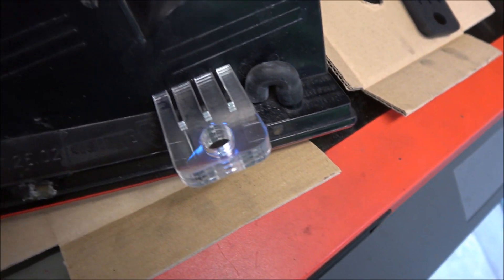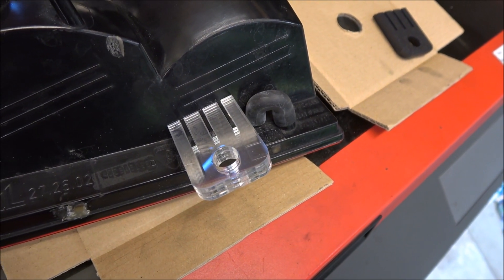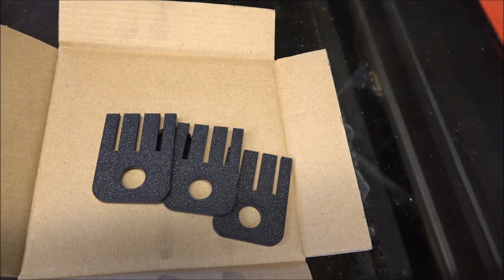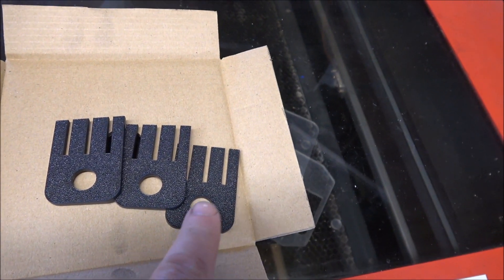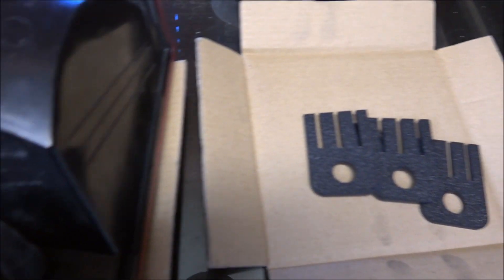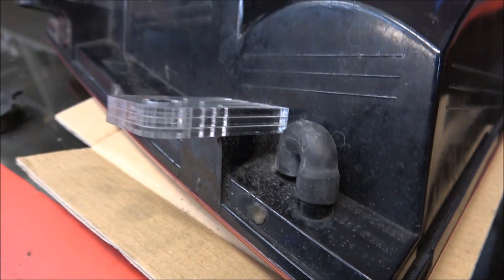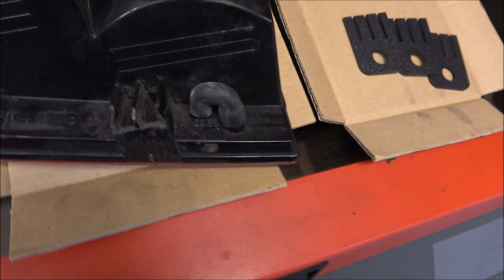What I've done is I've laser cut three layers of acrylic. I'm not going to use acrylic for the final one - this is for illustration and test cuts. Here is the final one: three pieces made to fit. Why three pieces? These slots actually get wider as they go down because of the draft angle from the injection mold. I just wanted to show you what it looks like fitted in place - if I glue that in there it's going to be really good.